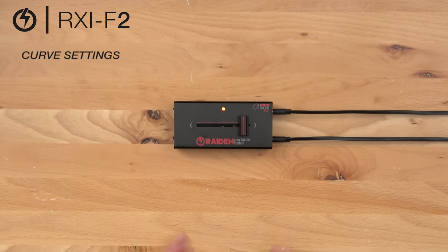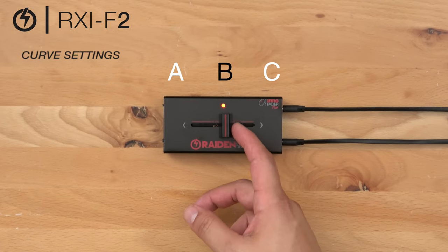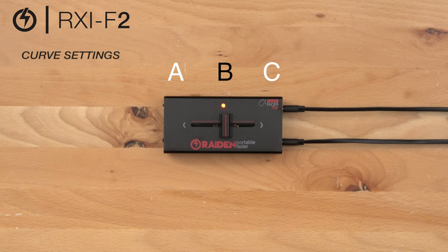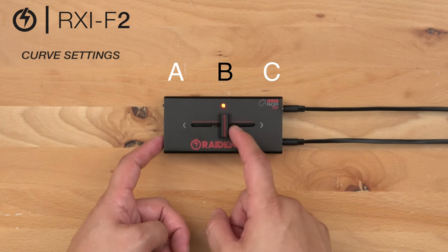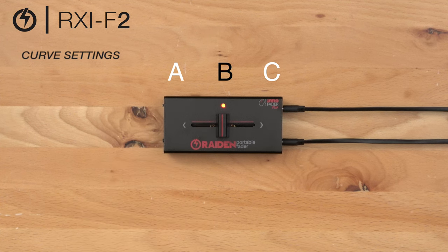In order to achieve a linear mix curve we want to start at position point B, hold our calibrate button down from B down to A all the way down to C, release the calibrate button to save our setting, and travel to C and back to B. Release the calibrate button to save your setting.